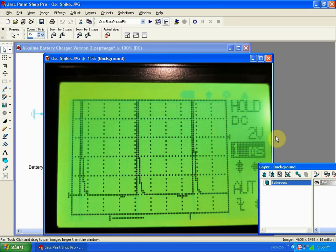This is a picture of the voltage spike going into a dummy load of a 1000 ohm resistor in parallel with a 0.1 microfarad capacitor. You'll note that the division is set for 2 volts, and you'll see 2, 4, 6, 8, 10 volts here — somewhat over 10 volts.